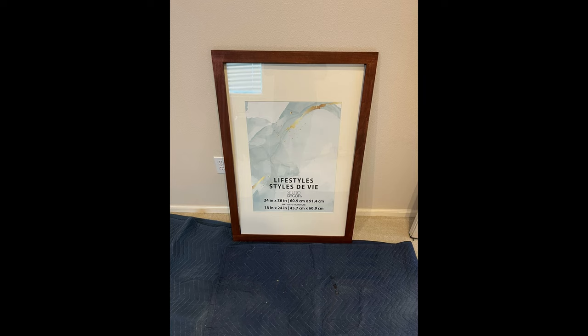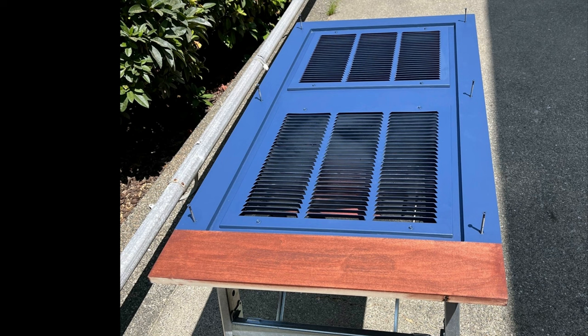This is a quick shot of the poster frames we built. The inside dimensions are just shy of 24 by 36 inches, so they'll fit most common movie posters. We had the client order standard glass picture frames off Amazon to keep it rigid on the front, then mounted those through the back using picture frame clips. These are Z-clipped on top with two Z-clips because of the weight of the glass, and they have rubber stoppers on the bottom to keep vibrations away.